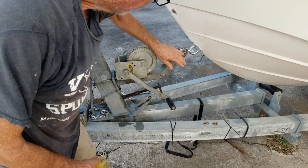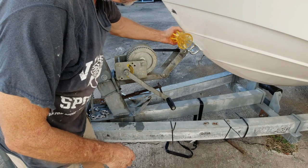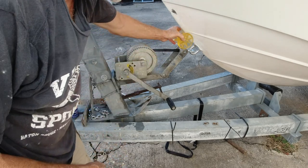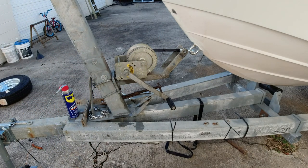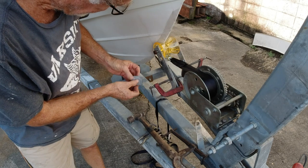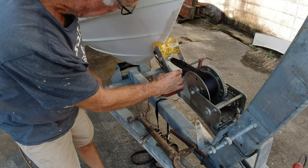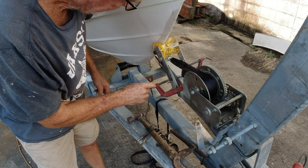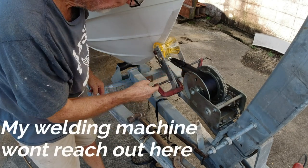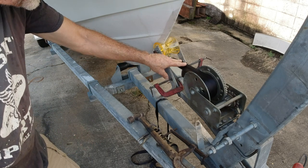I have a conflict — these aren't wide enough. I'm going to amputate these right here and see where we can go from there. I may make it even a little bit lower because that would make it easier to get the wheel in place. So I trimmed these two pieces off the original bracket because they were hitting the roller, then went to my junk pile and found some galvanized stuff off a boat trailer. I've got it clamped where I want it, and I'm going to weld this and cut the dog leg off.